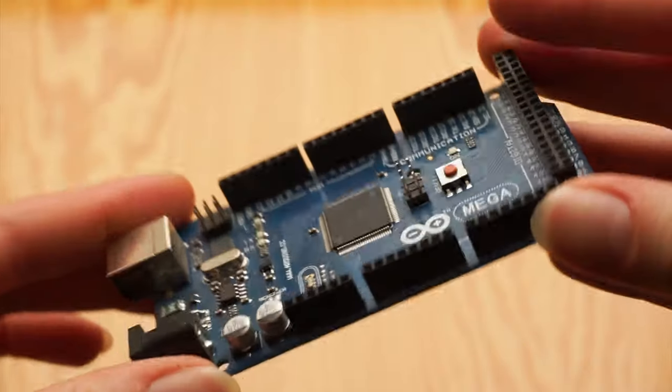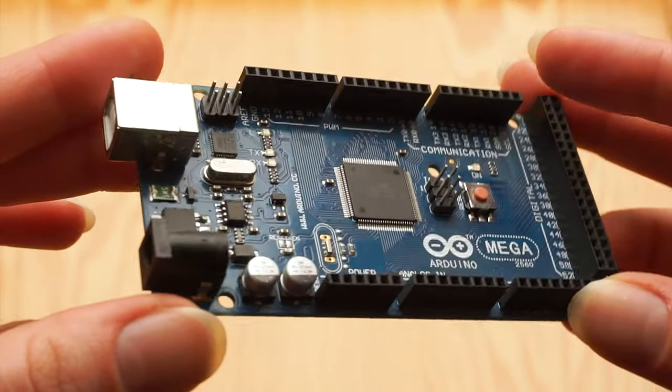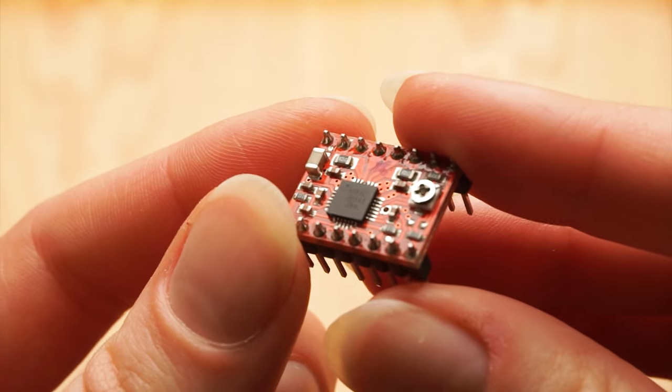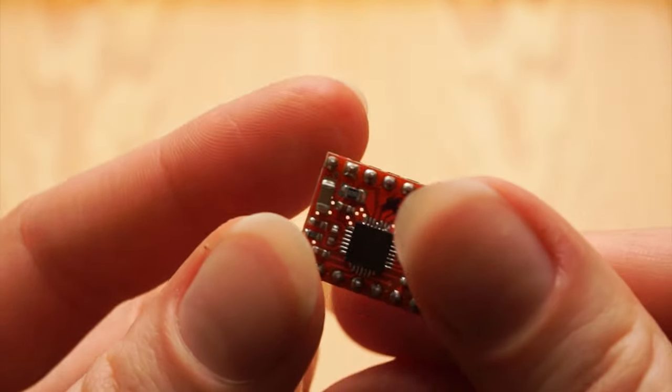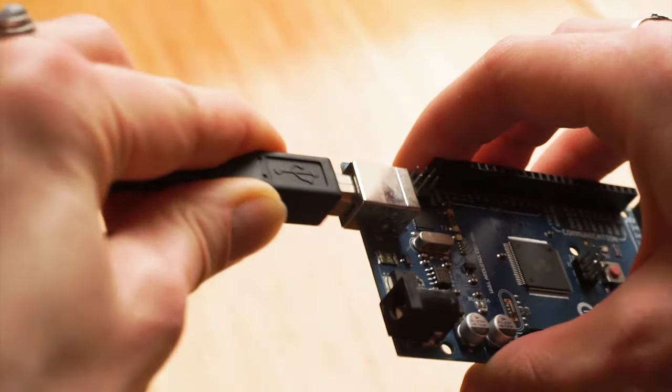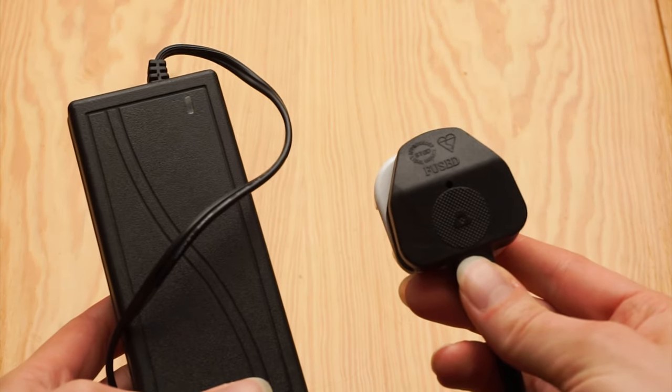The next step is for me to actually talk to the motor, so what I will need is a computer. This is an Arduino Mega, which is totally overkill for the project — I just need a few pins at most. It could power a mini robot or a 3D printer. But if I connect the Arduino directly to the motor, it's going to fry up. So what I really need is this — a stepper driver. It's going to go in between the Arduino and the motor, and that thing will do the heavy lifting, because the motor in robotics is just a heavier piece to work with. And to finish, I just need a cable to connect the Arduino to the PC and a power supply to juice everything up.